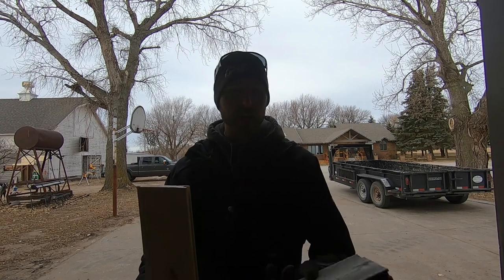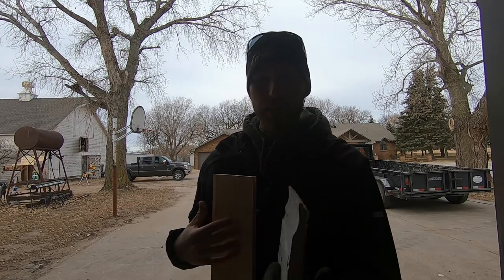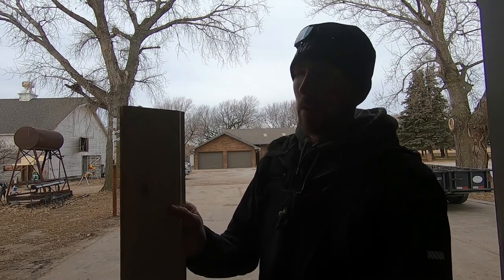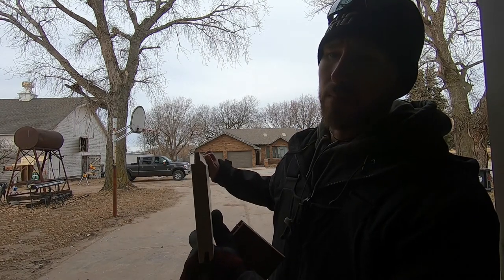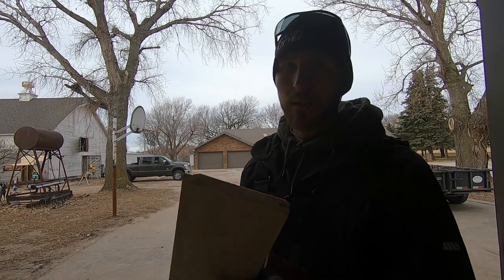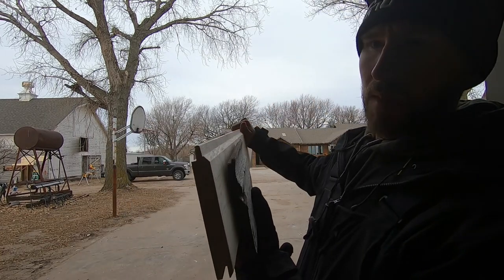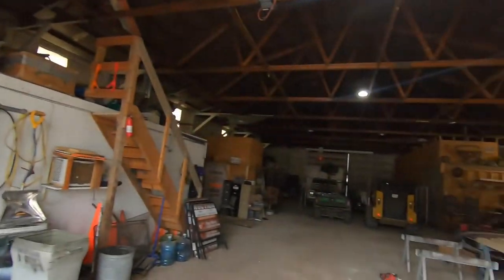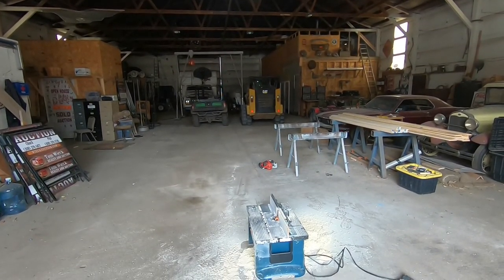So I'm trying to match the original car siding. You can see that profile is kind of like a raised panel you would see on cabinets. The car siding that's available to me right now has a very sharp profile versus that gradual sweep. So for a side-by-side comparison, to try and match that, roughly the dimensions are the same. I set up my router table and just put a raised panel bit in there.